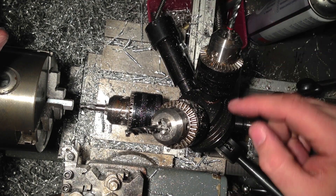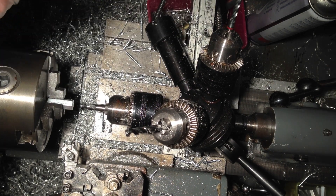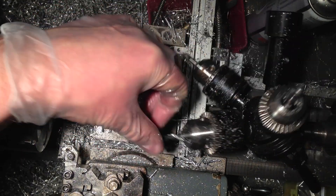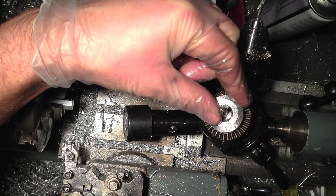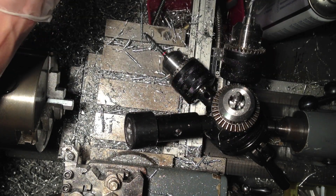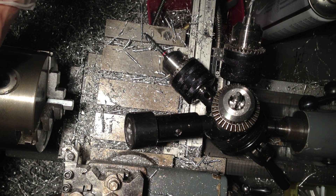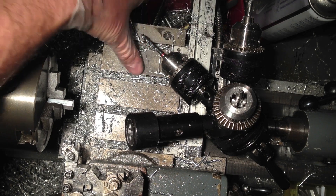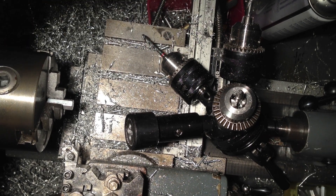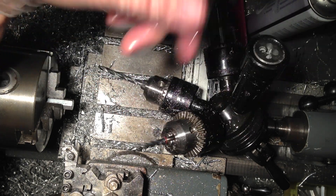This is a particular custom head in so much that I've got three chucks. Ordinarily the offering you've got on eBay, you'll have two chucks, a die holder, and then typically a live centre on the fourth position. My operation for this particular project has no need for a live centre, so I gave the guys at RDG a call and said I want a quad head but I don't want a live centre. They said no worries, we can swap it for a third chuck — which is basically what I've got here. So I've got my centre drill, my drill, and my tap.